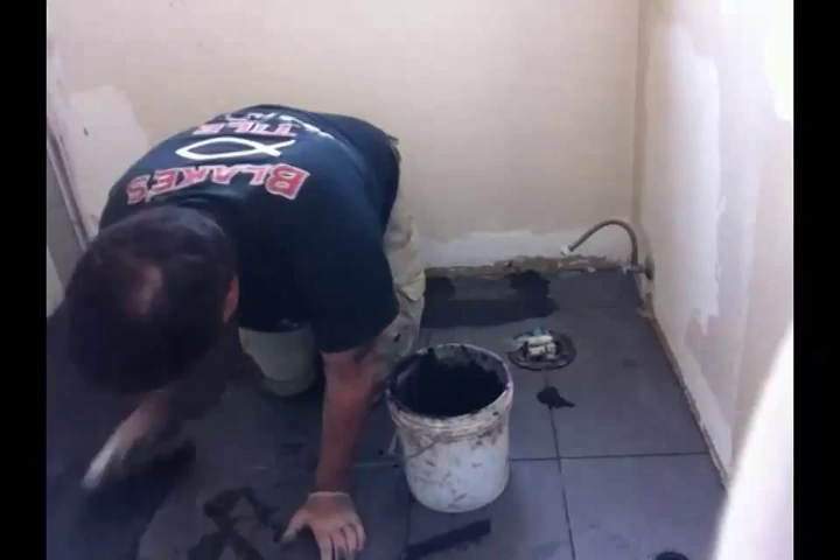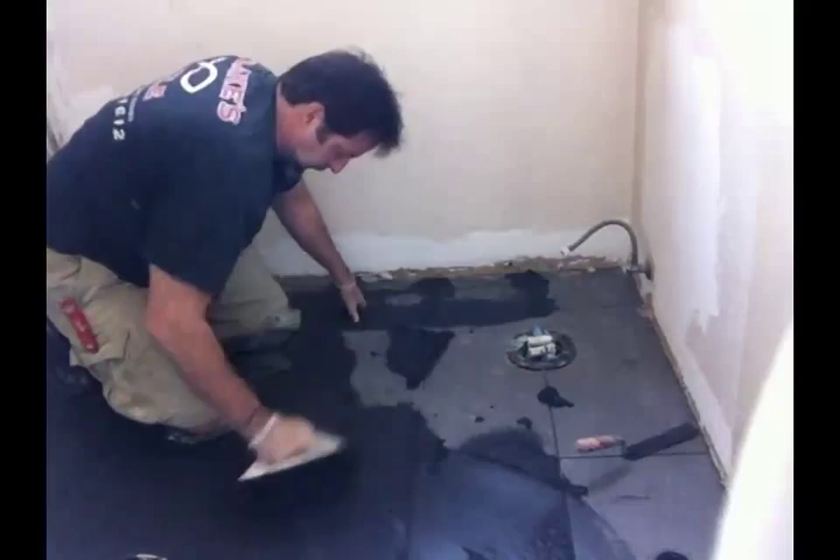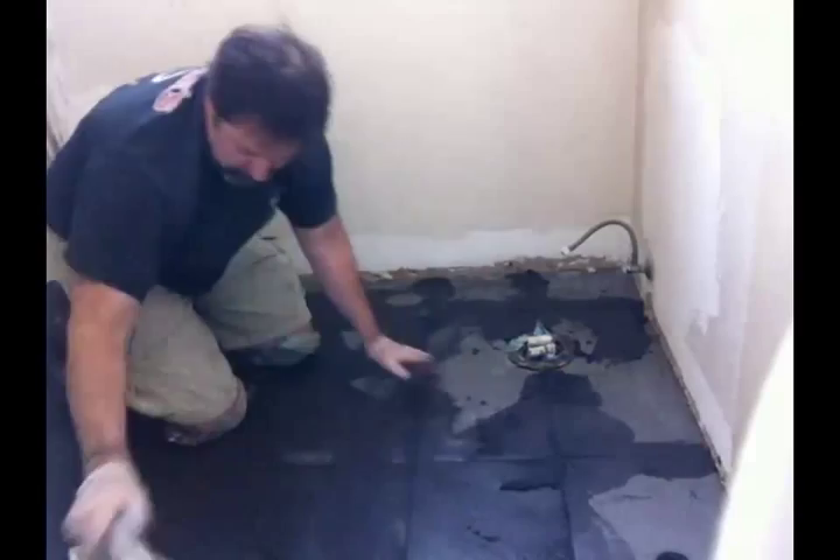The floor is all in and now I gotta clean up everything and grout. Look at that blue tape — always use blue tape for your rock carpet. When you mix your grout, let it sit for five minutes before you start. Make sure everything's nice and clean. Use a 45-degree angle with your rubber grout trowel. Dark colored grout stains like crazy, so if you think it's going to stain something, tape it up with blue tape. Use it like a squeegee — get it all up.